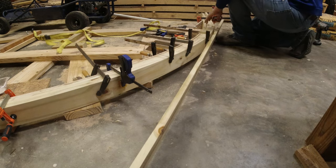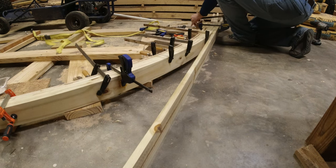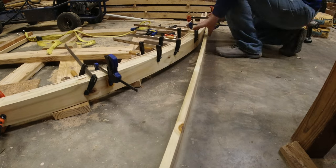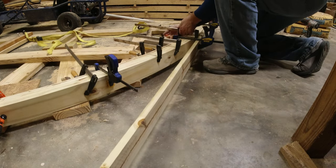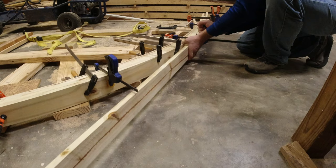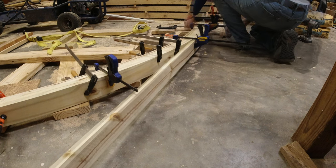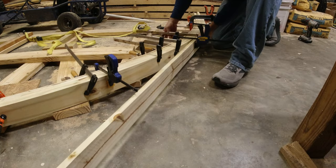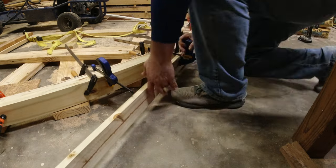As you can see here, getting this one started — the very end of the plywood in general was hard to get started. But once that was secured, going around the arch was pretty simple. I really needed another support piece here in the beginning. As I was adding more and more 1x4s to bend, that plywood was wanting to flex a lot more and didn't have a whole lot of pulling power. Another support maybe beyond the edge of the arch would have really helped to pull things up nice and tight.